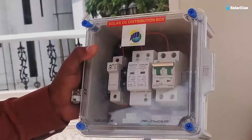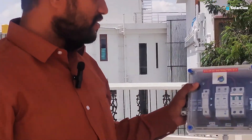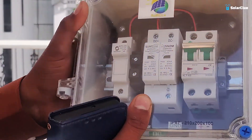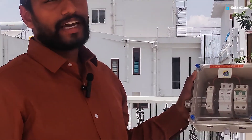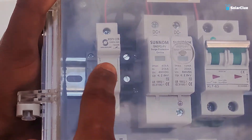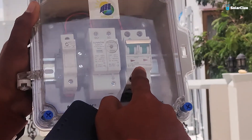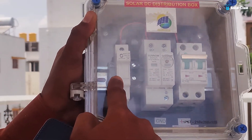This is called the DC distribution box. This box has all the primary protections — a DC fuse, DC SPD (surge protection device), and DC MCBs. This box is used to combine all our panels. The lightning arrestor captures the first level of surge. Whatever voltage leaks through the panels is then captured by the surge protection device. The MCBs allow us to disconnect the DC side whenever we need to check or service the panels. The fuse on the positive side controls the panel current.